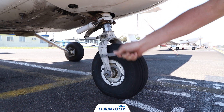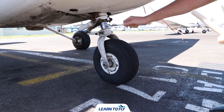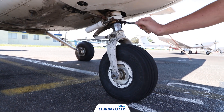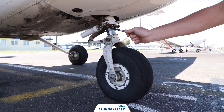Check the air filter is clear of any obstructions or foreign matter. For the nose wheel strut and tyre, check inflation and condition. Check the oleo strut — the outer cylinder fixed to the airframe — it should be roughly four fingers of height. If it is flat or sitting on the flange, let an instructor know. Check the shimmy dampener for security and any general wear and tear.